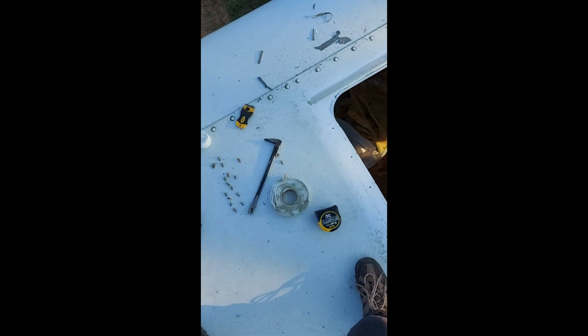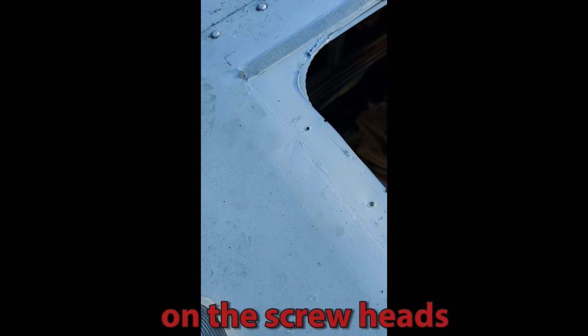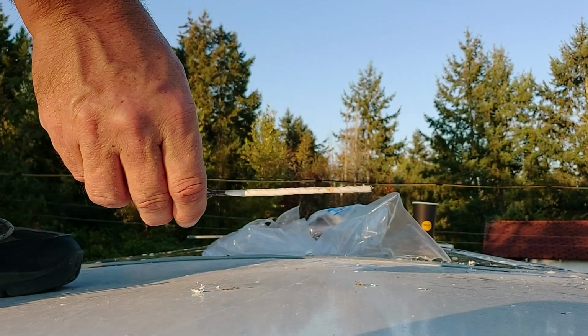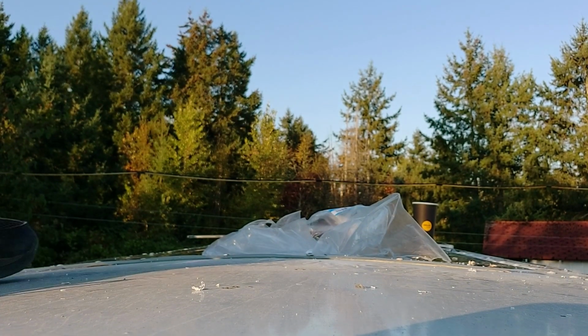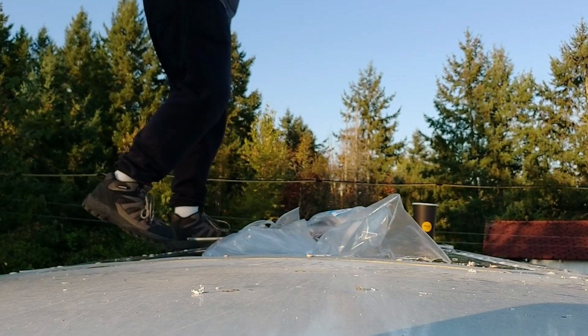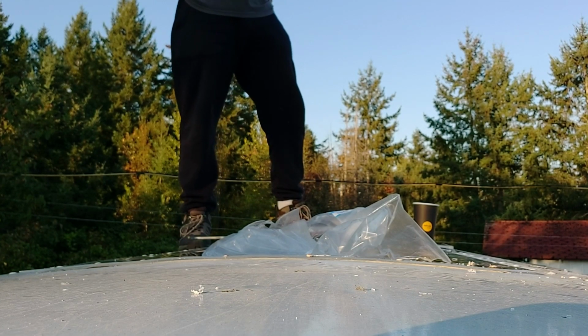Here we go. Putting down the butyl tape. I love this stuff. It is such an amazing product. I'm going to do all 4 sides and then lay it down on there and get a couple of corners done and start screwing away. And then I will finish with a bead of caulking around the whole piece of quote-unquote glass, and it'll be a beauty. Right on. Poker. Just an old drill bit that's no good anymore, but I've obviously used it before.